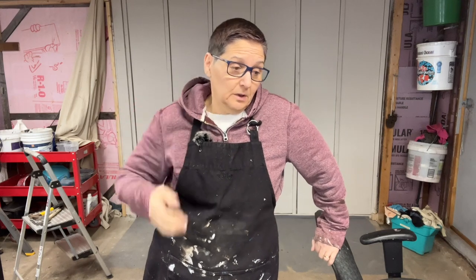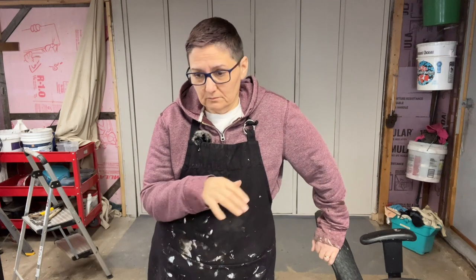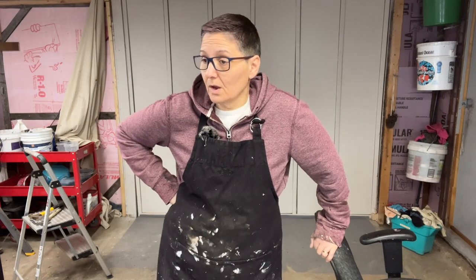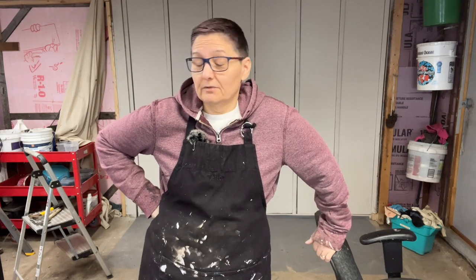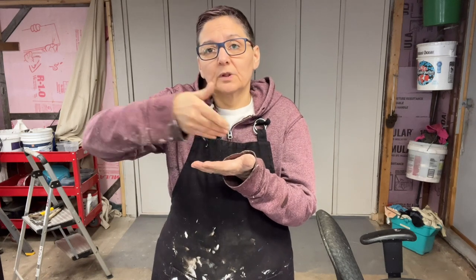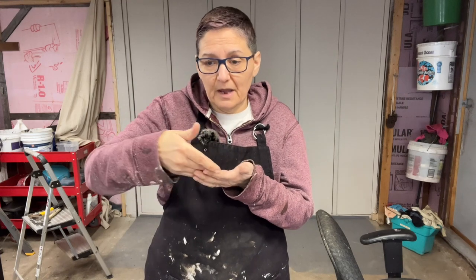I figured I need to disguise a lot of this table. I did the first coat, let it soak in, wiped it all off, and it was blotchy all over. So I ended up doing the gel stain with a chip brush. I'm not a fan of chip brushes — we all know they fall apart mid-project and get stuck in everything. You absolutely don't want them stuck in your stain. But the chip brush is kind of rough on the end, so when you lay the stain down you can actually manipulate it in the same pattern as the grain of the wood to make it look like wood graining. It works fantastic.